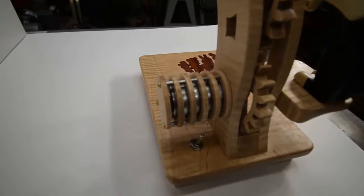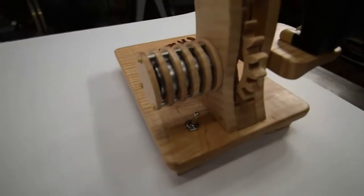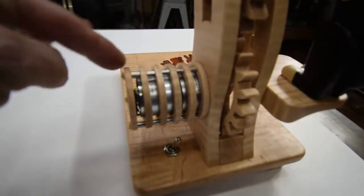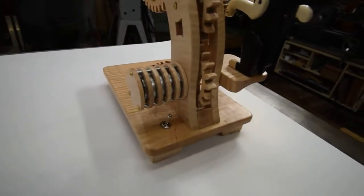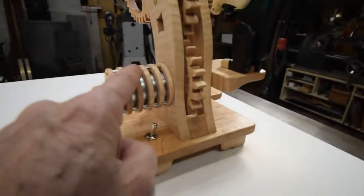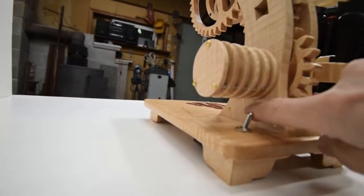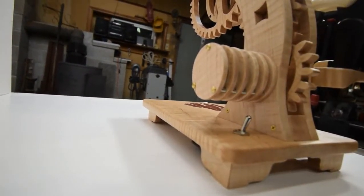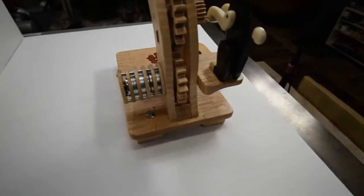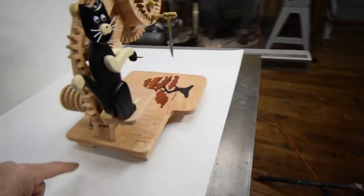So I went through a few different designs in my mind, and what I was inspired by was the cooling fins on a motorcycle engine. So I just cut a series of discs, put spacers with a brass screw, and that covers the motor. There's a 9-volt battery underneath. In order to get the wires from the motor to the battery without being seen, because I didn't want to see them, I drilled a hole inside this back base and brought them right down underneath. I also moved the toggle switch from the front to the back because I didn't want to see the toggle switch.